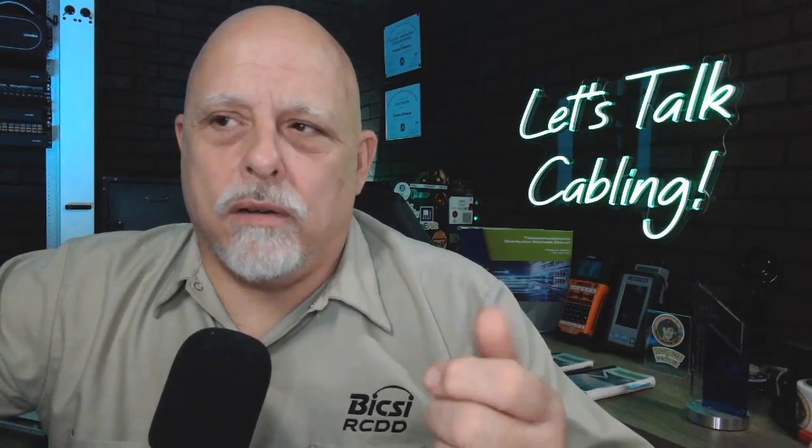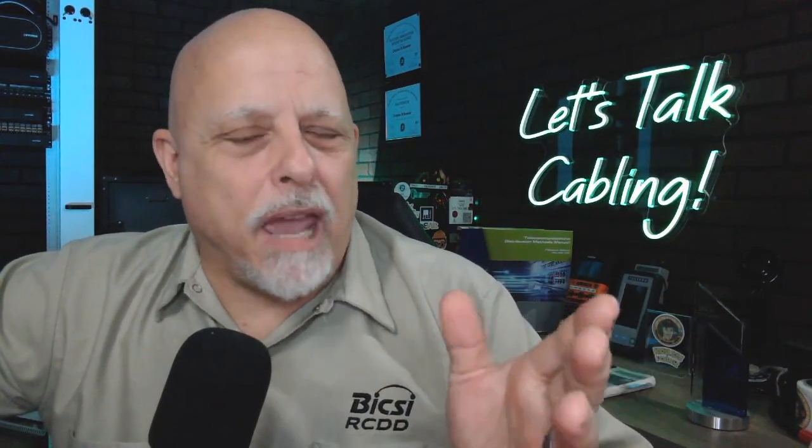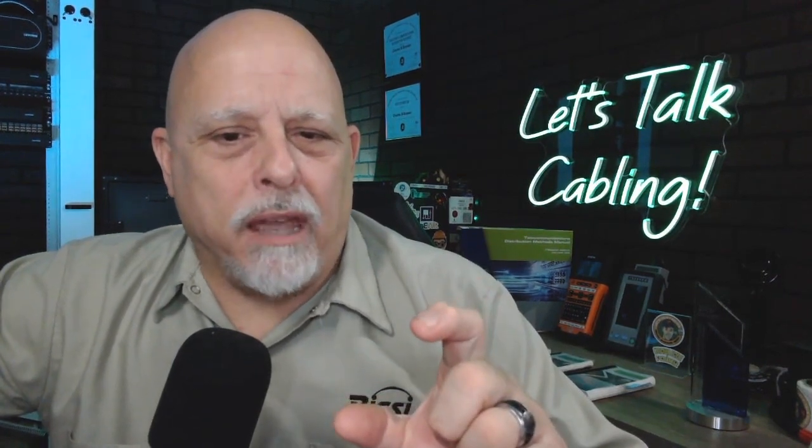I'm assuming the fusion splicer is AC, but don't they have battery ones too? Or they can operate off of batteries? Ours does operate off a battery or can use an AC charger. Gotcha. How many fusion splices can you get off a battery, just out of curiosity? Depending on the technician, for an average technician doing 2 minutes or less per splice, a battery is going to last about six and a half hours, so about 200 splices per day. Well, if you factor in lunch and two coffee breaks, that's an 8 hour day, right? Well, with ours, you can also charge it while you're using it.